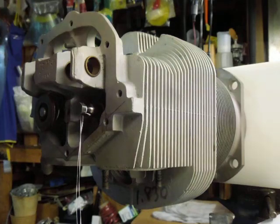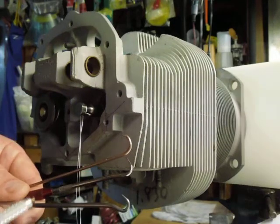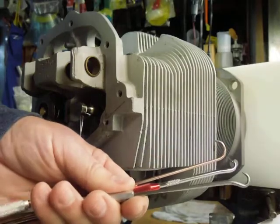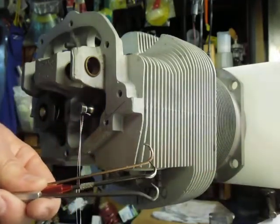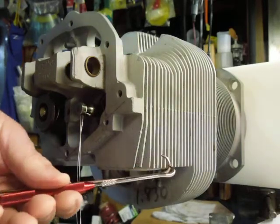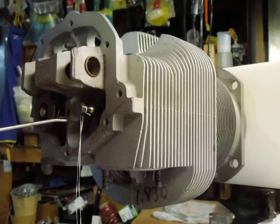I knew I had an old cylinder so I mocked it up just like it'd be on the airplane, sitting here horizontal. I got a piece of wood down inside the cylinder making up the part of the piston. Here's what you do: you basically need two hook tools. Magnetic is good — if one end isn't magnetic and you happen to drop it in the cylinder, you're gonna have a hard time fishing that out. I made one tool out of a piece of welding rod which seems to work real good. Then you need one that's small enough to reach down through the valve guide to pull the piece of string back out.